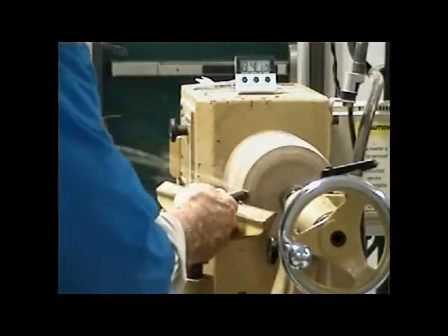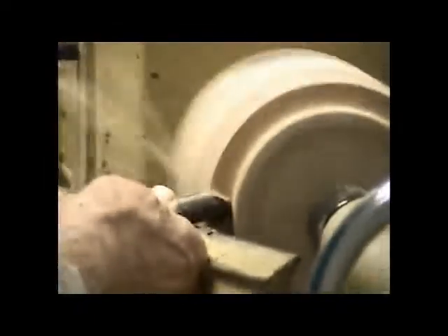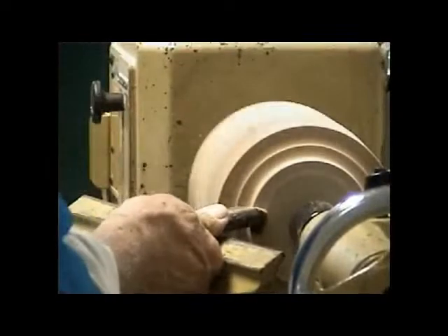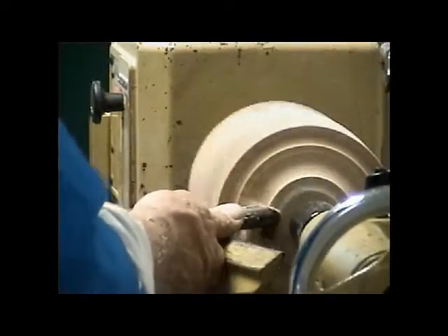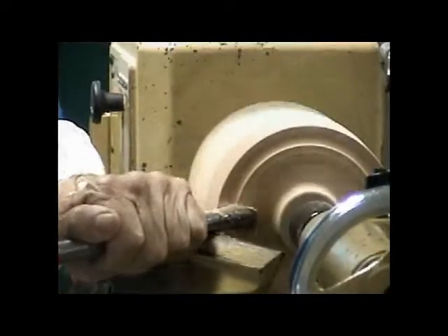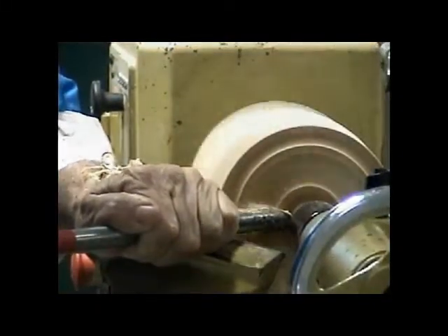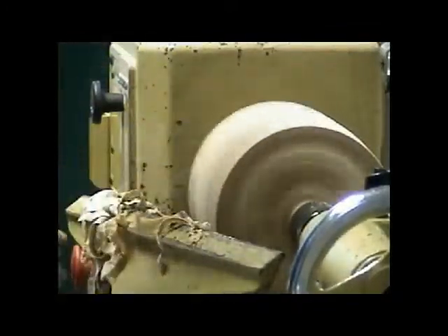The first thing I'm going to do is kind of flatten off the very bottom, making a series of very shallow cuts going straight in towards the headstock. The bevel actually rides on the little cylinder that you made. At the end there you saw it shift into a pull cut before the long edge of the wing gets into the wood. So we're just flattening it off with a series of push cuts and scraping cuts.